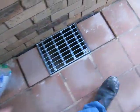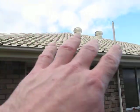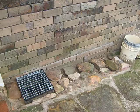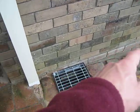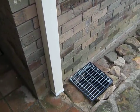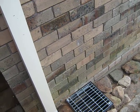When you walk into this bedroom you get no musty smell, even with the window closed — it smells nice and dry. You can smell the new carpet but that's the only real smell. These vents are now providing circulation underneath the bedroom. That point on the roof is where the water droplets were. Now it's venting underneath and it's drier under there. Plus I've dug a channel around the wet rubble area to dry it out underneath.